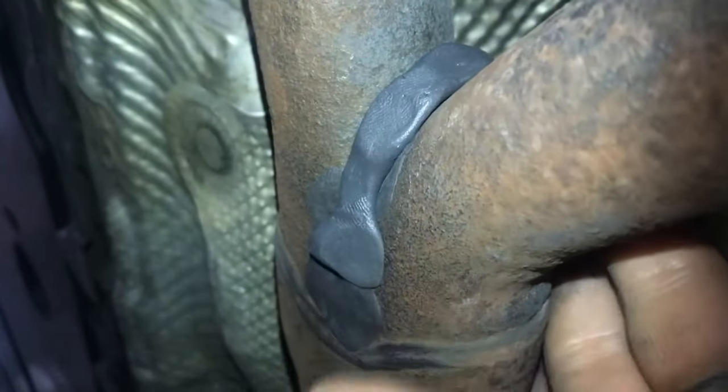Press the epoxy into the crack until it sticks to the metal. Work it in with a stick to make sure everything's in there. If you need additional, just add a little bit more until everything's filled. You've got about five minutes for this to set and it takes an hour to cure.